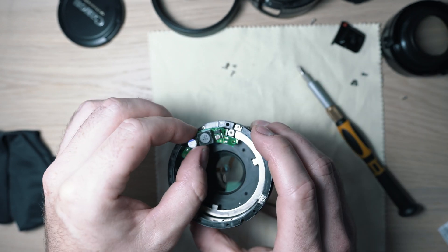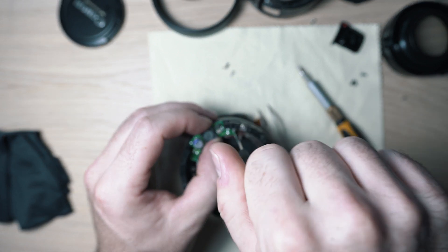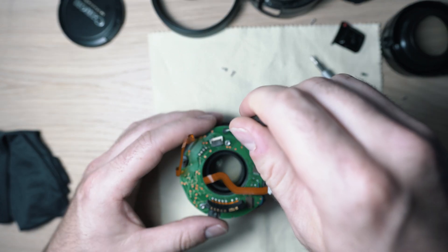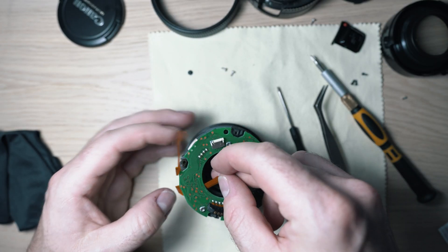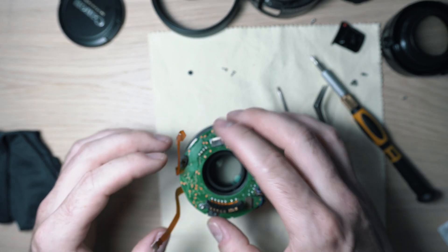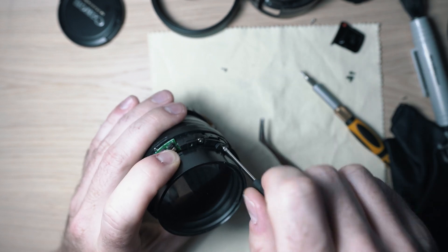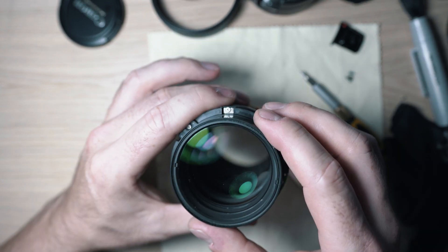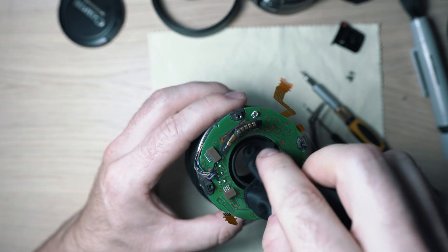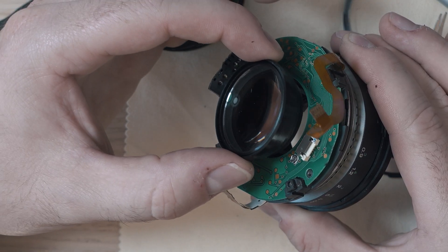Next is a small PCB held on by two screws. Now I have to unscrew the lens board again and feed the iris ribbon cable outside, as that's the proper way it goes. Moving on to the front element — make sure it's clean and the three screws are tight. Now the inner parts are almost done. Clean the rear end and screw the rear element on.